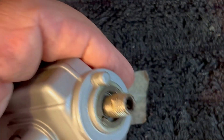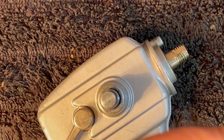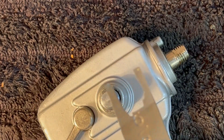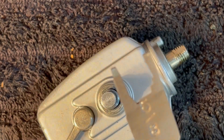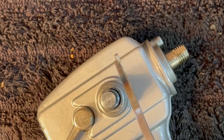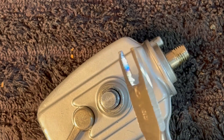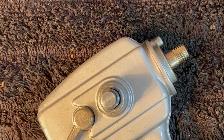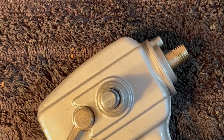I'm back. I have no idea if this is going to work or not. But I took a 5-inch drill bit and ground it down, ground the center out of it, and flattened it a little bit so it'll fit into the notches. I have no idea if this thing's going to have enough strength to hold this or not, so we're going to give it a try. Instead of grabbing it all the way up there, I think I'm going to grab it right here as close to the end as I can to try to eliminate as much twist as possible.